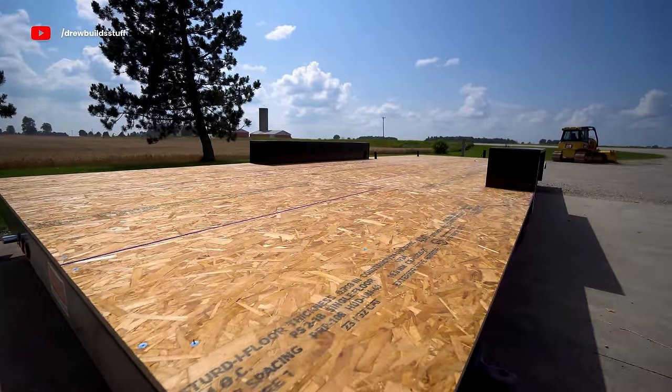Either way, the roof plywood was fine exposed to the sun for a few weeks. So this is some stick-down roofing membrane, and I'm going to be putting a metal roof on here. This is a really good thick underlay that is actually pretty much waterproof just itself.